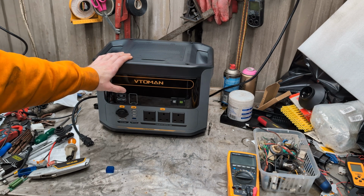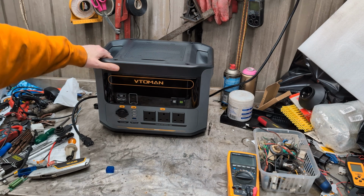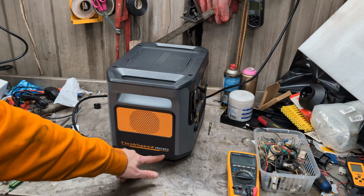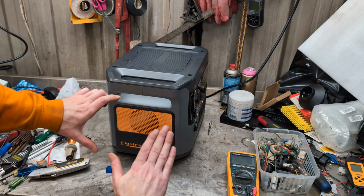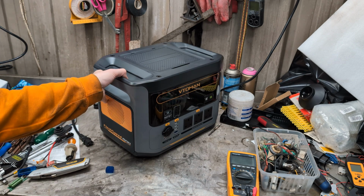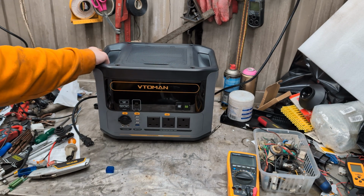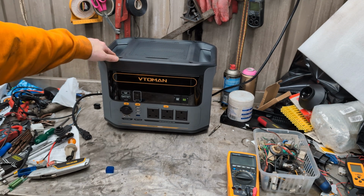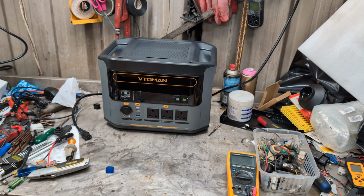Ease of assembly and disassembly. I'm going to give this a 6 out of 10, because the hardest bits to get back on were these side panels. I did actually snap both bottom tabs on this side. You have to fish it under the tabs at the sides and the top clips in, and then you have to bend the bottom bits to get them to go in. But it's broke, though still attached. It might rattle a little bit. And for disassembly, you'd have to unsolder bits on the board to get everything to come apart. But not impossible, and not all potted into place so you couldn't repair it. It's just a little bit of effort required.